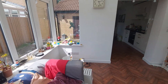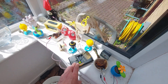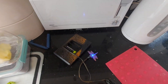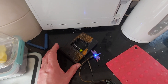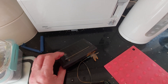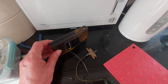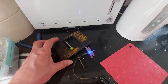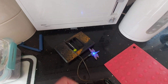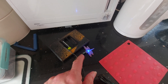I'll have a look at that solar panel and see if we can get it to run the cat rocker. It was obviously too bright in the conservatory — as soon as I brought this in here where it's a little bit darker, the LED comes on. As soon as we turn it over, light strikes the solar panel and the circuit turns off the LED and diverts the power to the battery to charge it up. As soon as there's no light, the LED comes on. So the plan is to get that to run the cat instead.